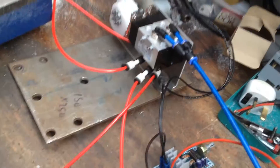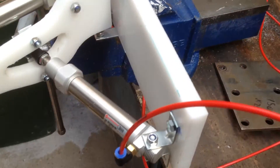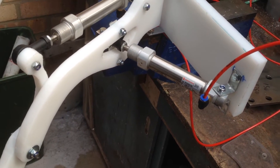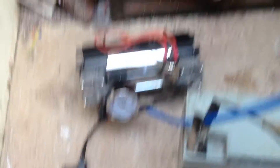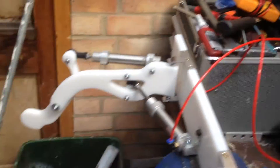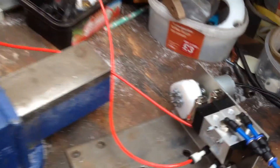So what I'm going to do is just run the system again so you can see these legs — it might be easier to see how things are when you see two identical legs moving as indeed they should. I'm just going to start the compressor up. It's stopping at around about three bar, which is what I'm proposing to run this thing on when it's finished. You can see it's going away there.